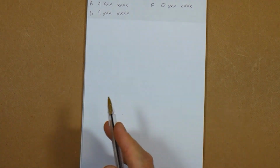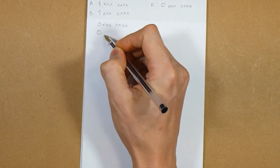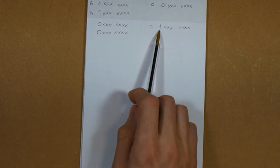And the other situation we could get is actually the opposite of this. If we have two positive numbers here, so the most significant bit will be a 0, and on our F output, we get a 1 somehow. For example, by adding here 100 to 50, we should get 150, but we won't, because the representation of 150 in two's complement is a negative number. So this last bit here is also corrupt, and we have to detect these two situations, and that's fairly straightforward.